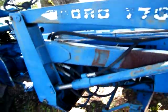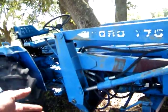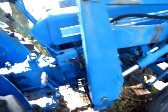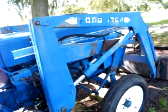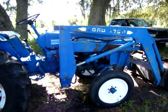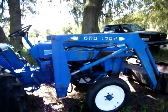Eventually I'll probably drop this, pull the loader off — just take these two bolts out and those two bolts over there, and those four bolts, drop it all off and set it to the side. But that'll be real heavy and the front end will be real light. Those wheels are pretty stout though — those rims are three-eighths steel in the center, so I'm good there.